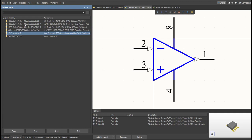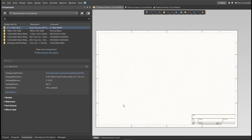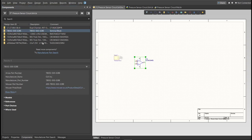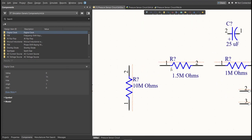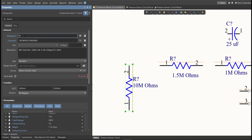Next, we are going to put all of this in our Schematic Doc. Go back to the Schematic Doc and click on Components. If there is no component in your panel, just press K on your keyboard, then click on Components. Now you can see the library for this project. We are just going to drag the library inside the Schematic Sheet. Next, we need to set the designator of each component. There are two ways to set the designator: we can set it manually by double-clicking the components, or we can do it in an automated way.